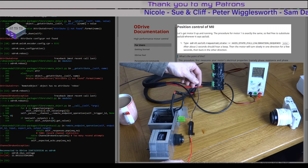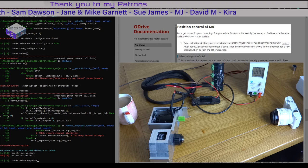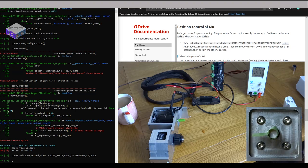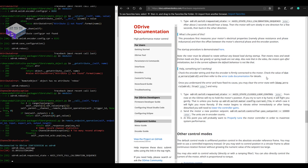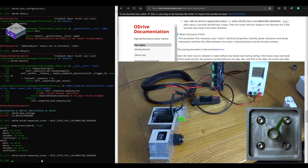If you do forget the resistor and you're running the system under load, you can actually damage the power supply and possibly the ODrive as well, where the braking power tries to go back into the power rail. Just do another one to clarify.